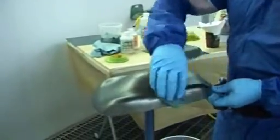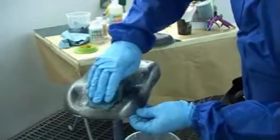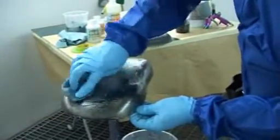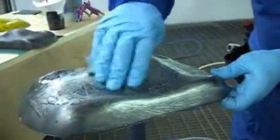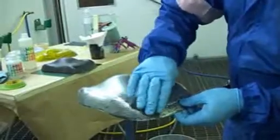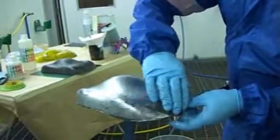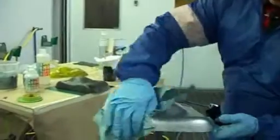When you're washing off the crystals, don't use too much pressure, let the rag and the water do the work. If you've got too much base coat on the surface and you're finding it hard to get through to the crystals, get an old piece of Scotch-Brite and plenty of water. Don't rub it too hard, but the base coat will sand away with that Scotch-Brite, revealing all the crystals.